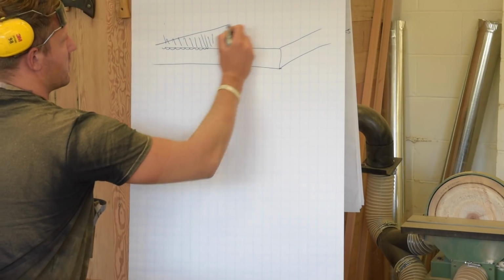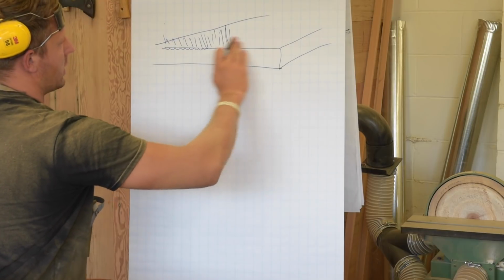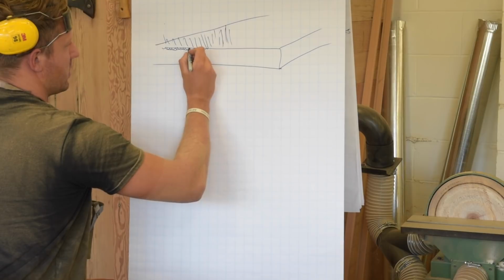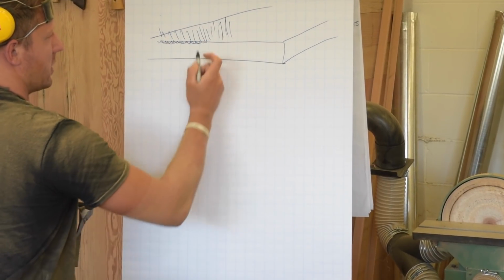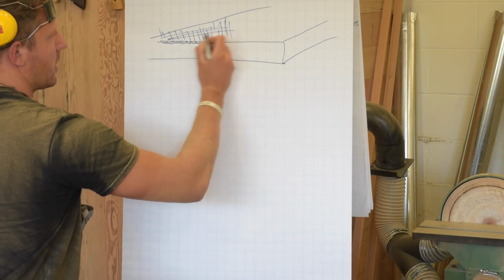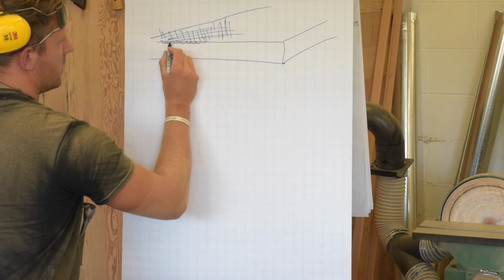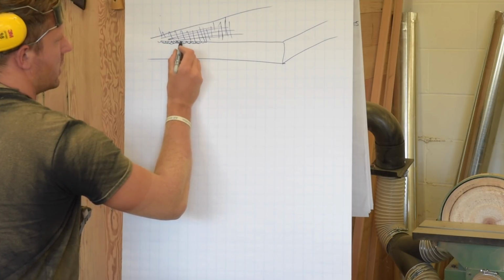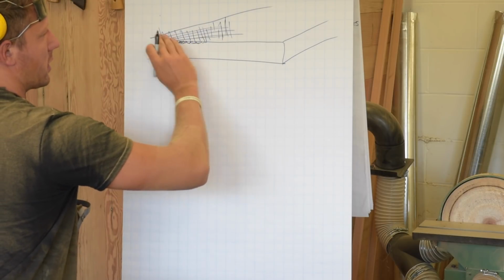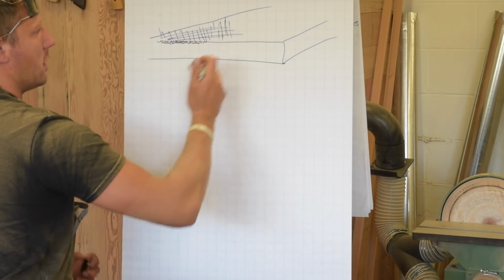So you're getting this scratch pattern on the wood, 45 degrees. Now if you just keep going in that direction, all you're doing is maybe digging these grooves a little bit deeper, and it's a slower process. Whereas when you change the direction and run your scratch pattern across that, the sander knocks down all those little high points in between the ridges and cuts a lot quicker, right? So when you go perpendicular to your pattern, it takes the material off a lot quicker.